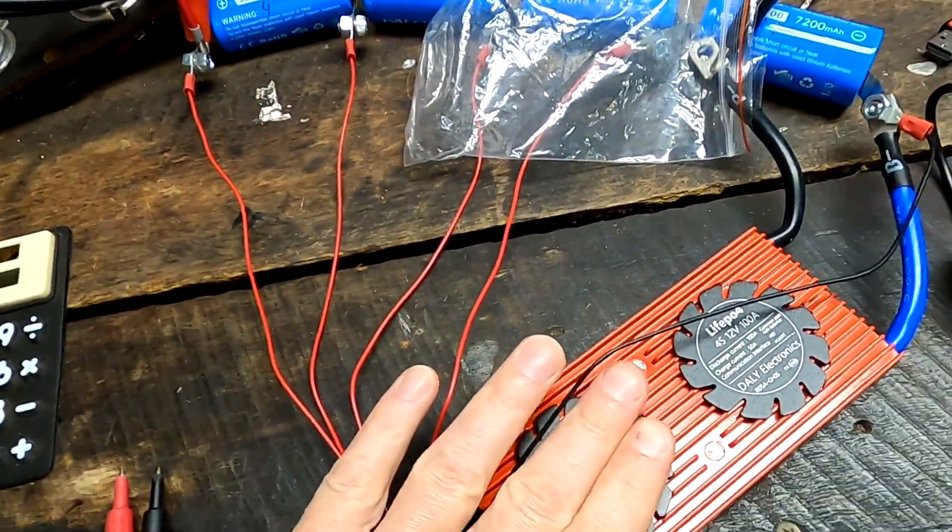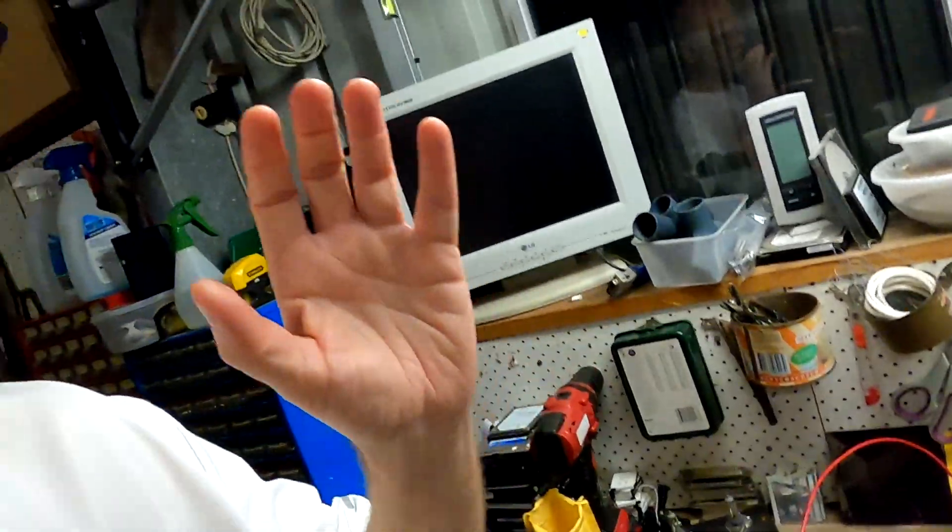As good as the MOSFET situation is — turning off charging during overvoltage while still allowing discharging — the balancing behavior of the DALY is frustrating. The QUCC BMS doesn't do the selective MOSFET switching because of its relay, but its balancing always works. I thought the QUCC BMS was really bad quality, but looking at the DALY BMS with this app and its ridiculous balancing logic, the QUCC is actually pretty good.